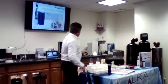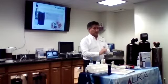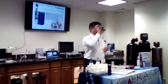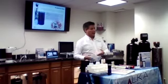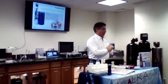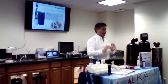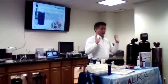And there's a lot of scale on most of the fixtures, the shower heads, or the piping in your showers. There are some expensive shower fixtures in some houses, and if they don't have the water softener, you can tell the scale builds up around the showers or the handles, and eventually you need to replace it. And that becomes really expensive because now you've got to get a plumber. Replacing the valves on a shower is really expensive because sometimes they even have to break the walls to replace the fixtures, because hard water eats metal, so it becomes expensive. So with a water softener, everything stays like brand new.